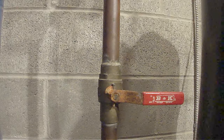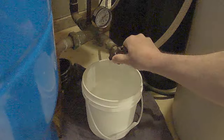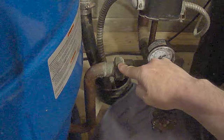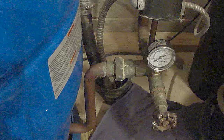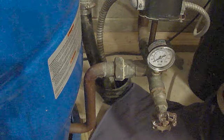I'll use a bucket to collect any additional water that drains out. Now you'll need to disconnect this main water connection fitting coming out of the tank with a couple of pipe wrenches. Everything will have right-hand threads, so that's righty-tighty-lefty-loosey.